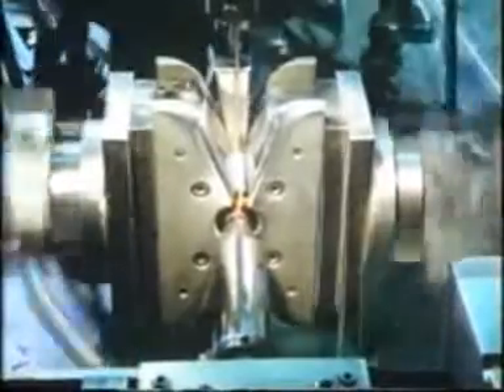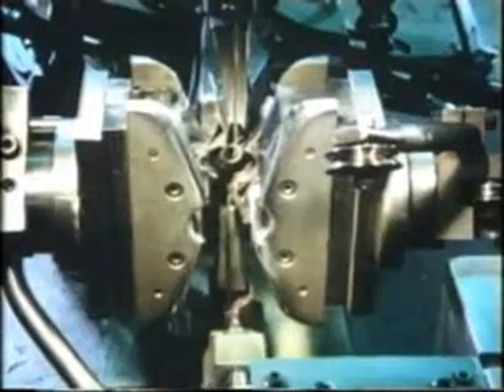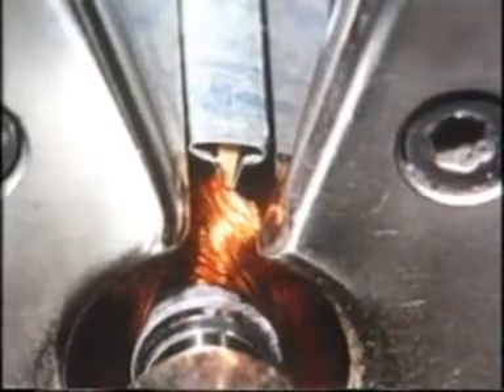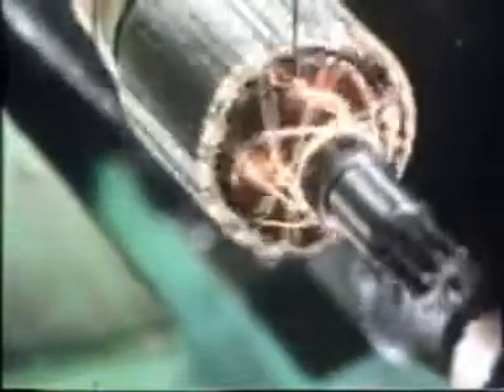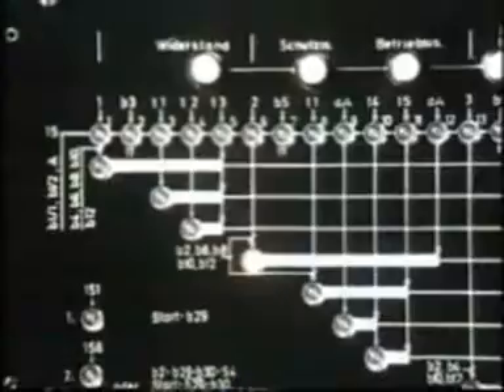The quality of an electric motor depends to a large degree on the quality of its windings. The fully automated armature winding machine coils the high quality esterimide wire onto the armature with a precision unmatched by the human hand. Polyester resin gives additional stability and improves the quality of the armature insulation. Only an absolutely true running armature can guarantee that a tool will be quiet in operation — that's why every individual armature is balanced and automatically reamed out, then tested a final time before assembly.